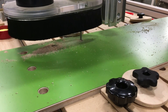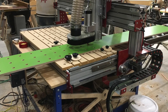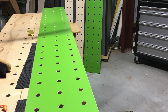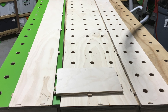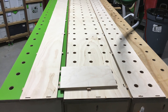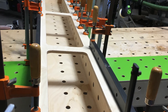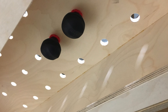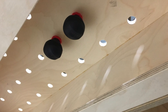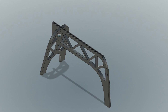In reality it could have been done faster with the Festool rail system and the router designed to drill these holes, but what it did do is save my shoulder from being sore from all the repetitive hole drilling. It also chamfered the holes for me automatically, and while the CNC was running I was able to take down the Christmas tree — so there's your added bonus. Here are all the pieces laid out ready to be assembled. I used the Domino joiner for alignment to keep the edges nice and tight, then just glued it together and clamped it up. Here are my box beams all ready to go. Because I used half-inch plywood, the Festool clamping elements — designed for three-quarter inch surfaces — required me to 3D print a small spacer that goes underneath when you tighten the knobs down, keeping everything nice and tight against the half-inch plywood.